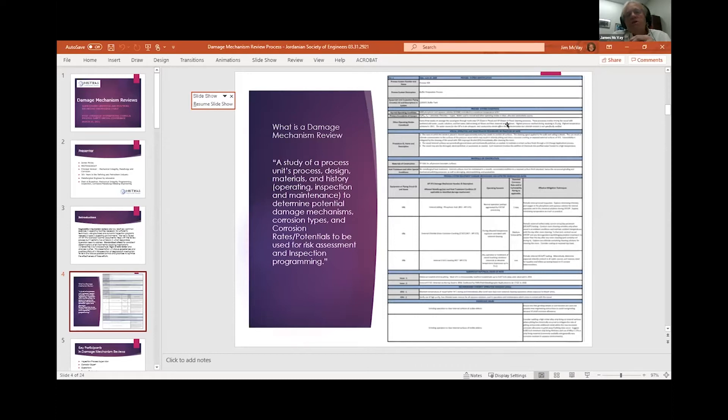The next section speaks to the process conditions the equipment is seeing — the chemistries, temperatures, and pressures inside and outside the equipment. In this case, the room was being cleaned with bleach every few days, which was impactive on equipment integrity. You also need to consider other operating modes. We're generally good at designing equipment for design process conditions, but what causes equipment to degrade and fail is often transient conditions, unusual operations, or unusual maintenance exposures. You have to consider everything, including materials of construction.